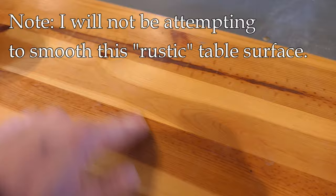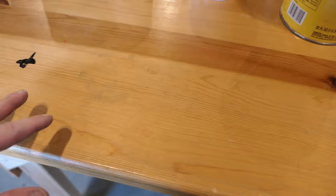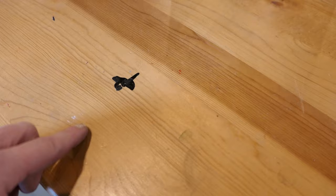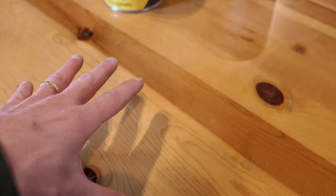This tabletop was finished in shellac and it's not very attractive — it's got knots and all sorts of defects. This was used as a utility table, but we can make it look fairly decent with a darker color. Ordinarily I might just leave the shellac alone and go right over it, but there are some drips of paint and other stains I want to get rid of. So I'm going to do a light sanding just to unify and make the finish uniform, and then we can start staining.